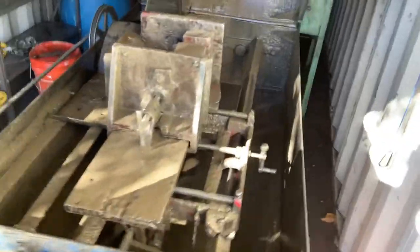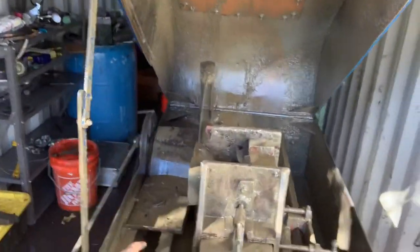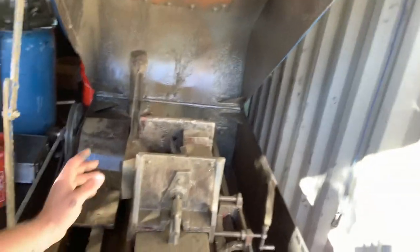So, because I've been running this saw for a while, next I'm going to do an oil change. I'm going to switch to some fresher oil because the lubricity is changing. And once this thing gets too filled up with the clay, it stops having the proper slipperiness. It doesn't have enough glide and it gets too thick, and then your cut gums up when you start to try to cut bigger stones.